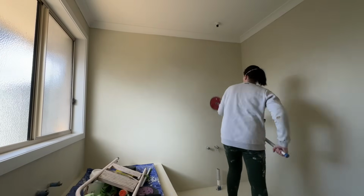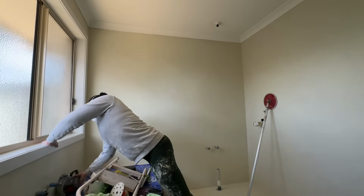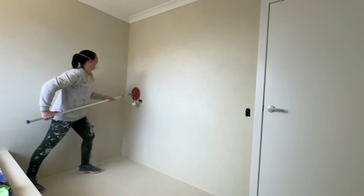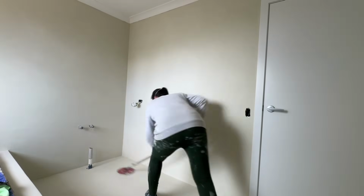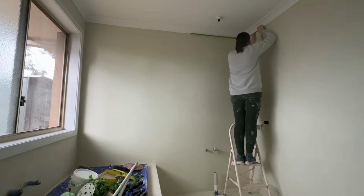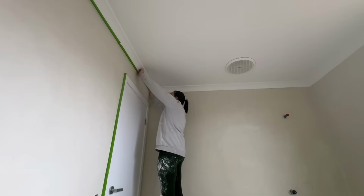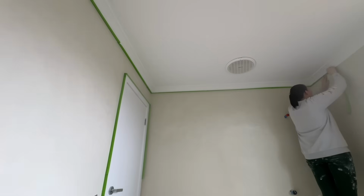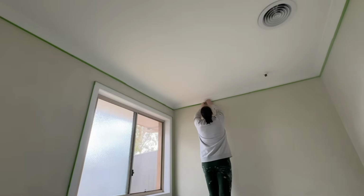Now the Smart Liso micro cement top layer was a fair bit softer than the base layer. So I didn't want to use a 40 grit sandpaper on this. I actually swapped over to a 120 grit to start off with, and then would move on to a 240 grit to get a really smooth finish between each layer. Also, just remember to remove the masking tape each day at the end of the day, and then apply new masking tape before you do each layer.